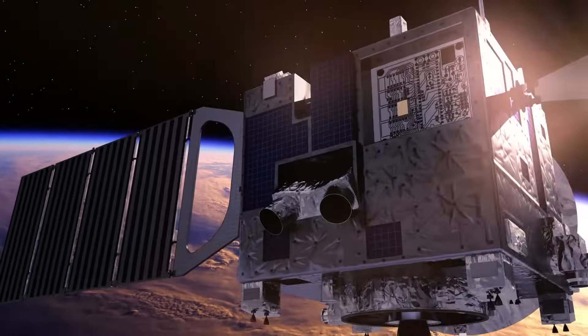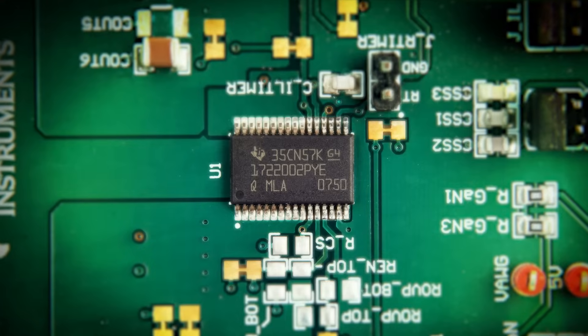Customers are being challenged today to design spacecraft, satellites, and other space systems that do more on orbit. They have higher resolution sensors, they need reconfigurable data channels, and faster bandwidth for data transmission. The traditional ceramic packaging used for space applications has become a limitation in how small those systems can get. So we needed a new type of part that would allow space designers to reduce size and weight while still meeting high radiation requirements. That's where we worked with industry and government to release a new spec called QML Class P.